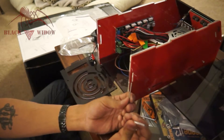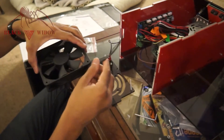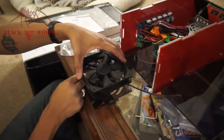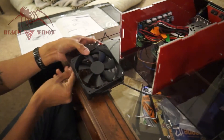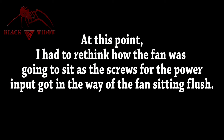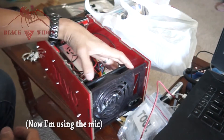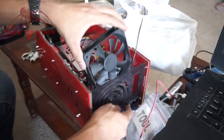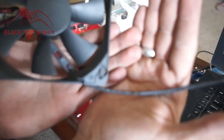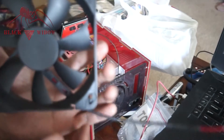The next step is to put the long screws through the two holes that hold the fan. Adding the fan with wires facing towards the power supply, going through both holes. I wasn't sure if brass inserts were needed — looks like they might. I managed to get the fan to sit flush against the back of the housing. To do that you can use a smaller bolt with a washer, or you can do what I did and drill a little hole right where the bolt lines up — that way you can still use the other two holes to mount it.